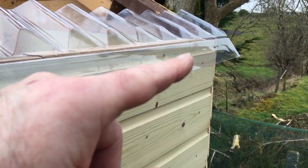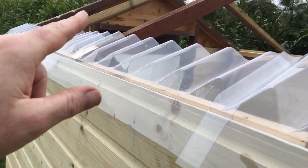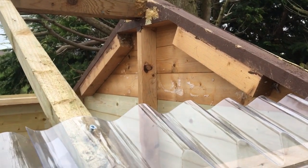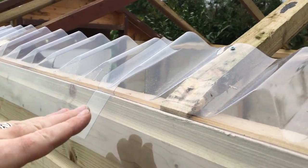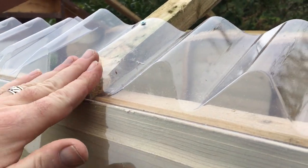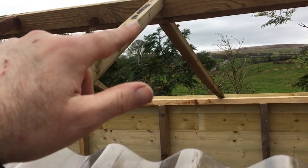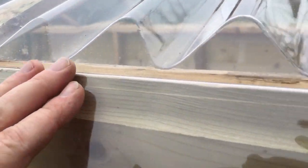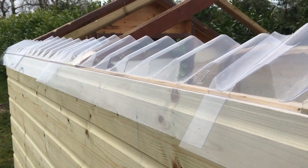So I've left it a wee bit longer there, and I've done exactly the same at this end here. Obviously these were the original beams for the roof — I'm just using them. I've replaced one of them, cut them down, had to chamfer the end. As you can see here, I actually just chamfered a wee bit of the edge so it wasn't a square edge. So if you can imagine that side is totally square — that's on the centre beam — this here is just chamfered up at an angle, so that means this plastic can run along the top of the shed.